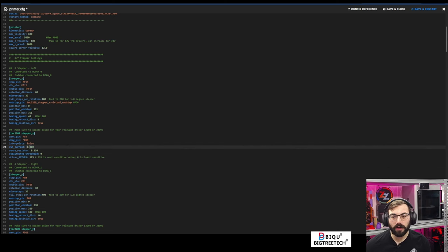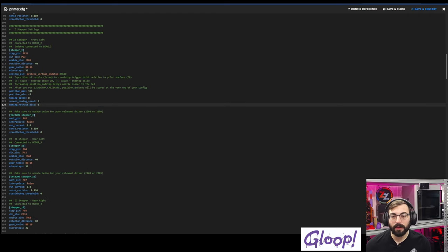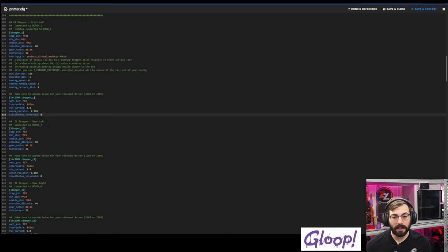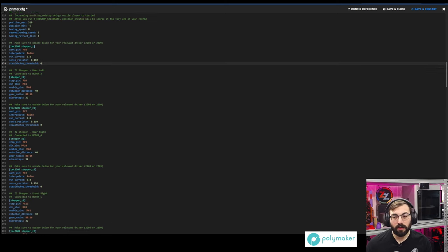You also want to make sure your run current is set. Right now I'm at one amp for these motors — I could go higher but I'm sticking with one amp for now. I'm not looking to go super crazy fast on XY. For the Z axis I have disabled stealthChop, so it's running spreadCycle — that'll allow us to go as fast as possible and be as accurate as possible. Current is 0.8, which seems adequate. It's on 32 microsteps, a good balance between torque and accuracy; we can change it to 16 if we need more speed.